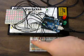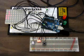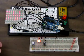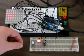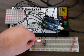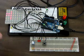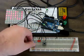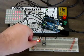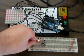And you notice down here what I have are 2 LEDs, and this is just a potentiometer, because I'm trying to utilize all the inputs, and they're all utilized right now. So what this does is allows me to select between basically 0, 1, 2, and 3 binary, which corresponds to 1, 2, 3, and 4, the pad numbers that I'm going to line up here.